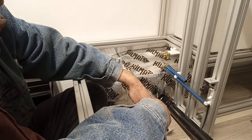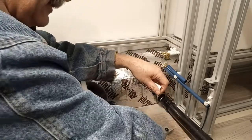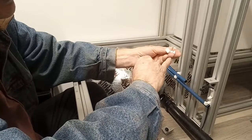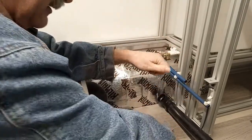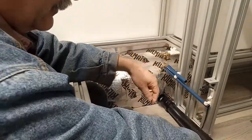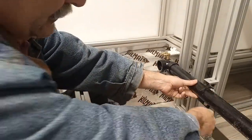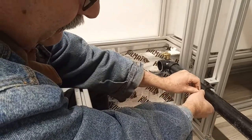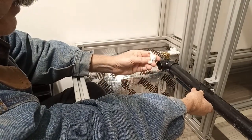I've also got to deal with the sink drain. This clip wasn't designed for a drain, but another feature of the clip is that it's got a little hole in the back where a zip tie can fit. So what I've done is cut the center out of this clip, and I'm thinking I can use that to support the ABS pipe. Then the zip tie will go around and hold them together nice and tight. That was kind of an unexpected use of the clip.